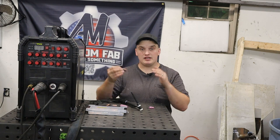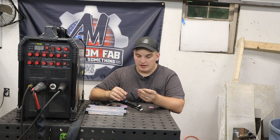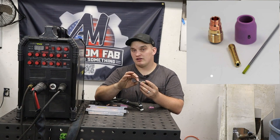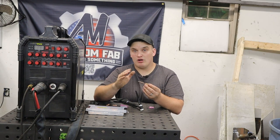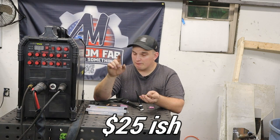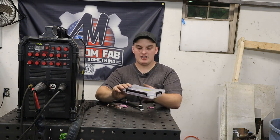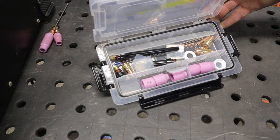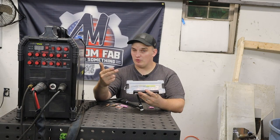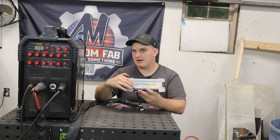When it comes to any of these stubby kits — standard or gas lens — I would get them from one of two places. First, if you want to go lowest dollar and get your foot in the door, I would go to Weld Metals Online. You can get a complete kit that's going to have a collet, a gas lens, and a nozzle or cone, all ready to go for right around $25. I've actually got a 10% off promo code that I'll leave down in the description. Or, PrimeWeld offers a stubby gas lens kit themselves which comes in three different sizes — you get one of each size for 1/16, 3/32, and 1/8 inch. With that you get one piece of tungsten in each size, one collet in each size, one gas lens in each size, and three separate back caps.